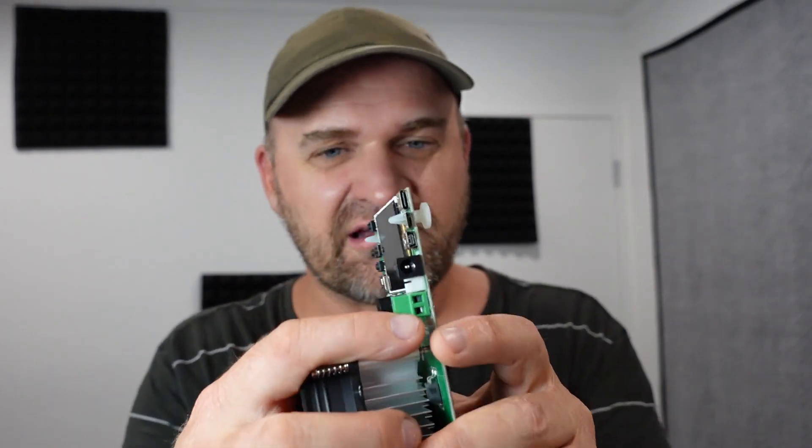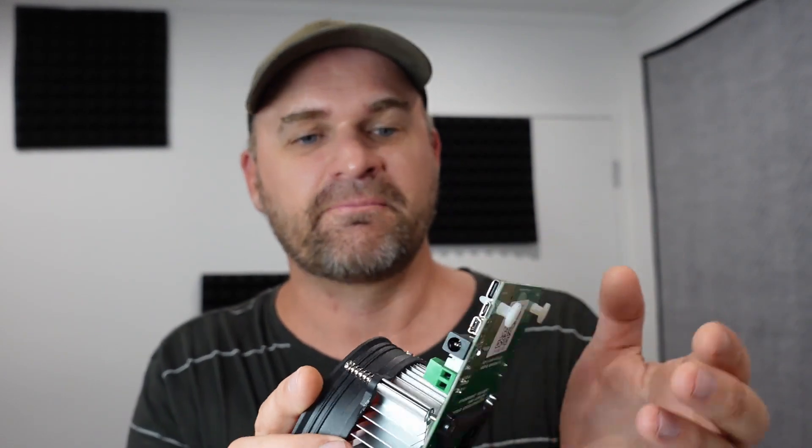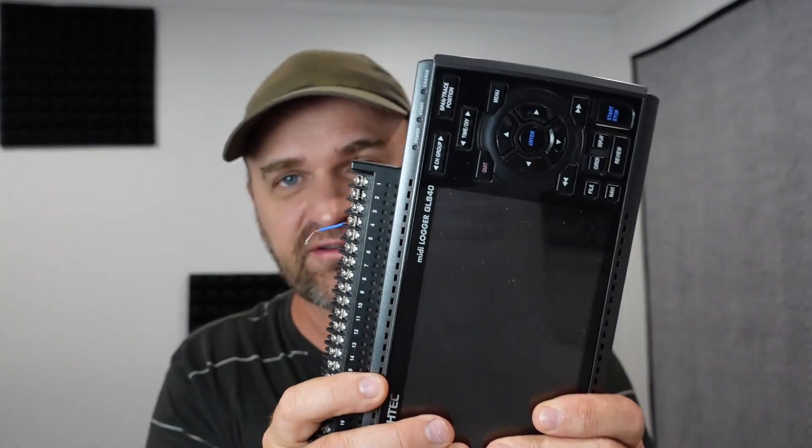To do that I'm going to use this load again. I quite like this little unit — it works well — but it's got terrible terminals. I was going to replace them myself but they've released a new one with good solid terminals and four-wire inputs so we can do accurate battery measurements. I'll put a link below, but for now I'll use this as a load and use this data logger to measure the time periods and voltage. Every 10 seconds I'm going to measure the voltage and log that on a spreadsheet and convert that into energy in watt hours based on a fixed load.